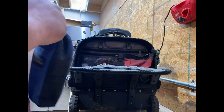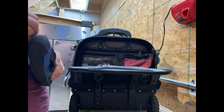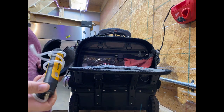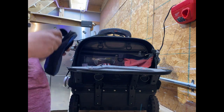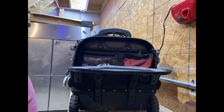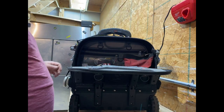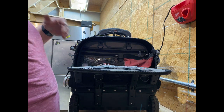Keep my manometers in here. Do a lot of gas pressure tests. So field piece manometers, wireless job link setup. Kills it for me every time I need it. It's great. Love it because it's got two manometers, so I can do static and dynamic same time on multiple pieces. I can do manifold and incoming pressure.